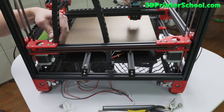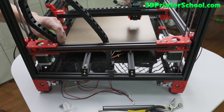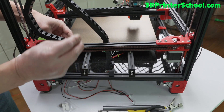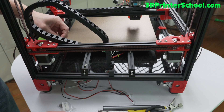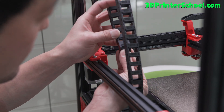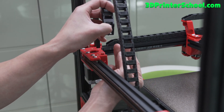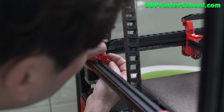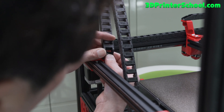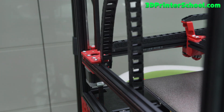Bring that piece up. You can imagine as the printer moves up and down, it's going to do that. You're going to attach to the other side here as well — basically this will go under here. Same thing at the one hole. I'm going to go ahead and attach this with an M3 by 10, and place this behind here. Go ahead and screw this in. That's attached very nicely. Now as the printer goes up, it pulls up real nice and goes down real nice.